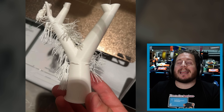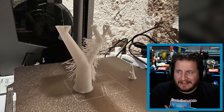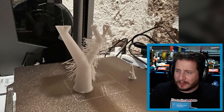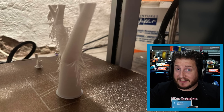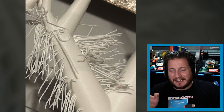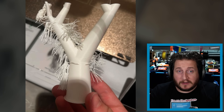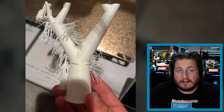This could also be caused by extreme back pressure. But given that this is a Bambu Lab A1 — a machine that has well-tuned profiles from the factory and in pretty much every slicer on the market — there's no real reason this should be happening. My best guess is it is a bad file. It could be they have the retraction set at a negative number, so as the machine moves it's just extruding filament. But it looks too consistent and honestly too good. Thankfully this is just on supports, so cut it off and you're fine.